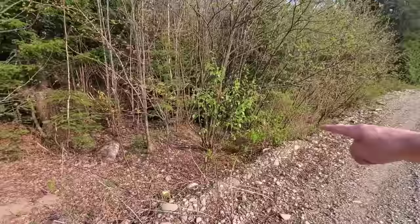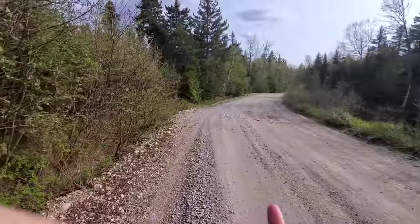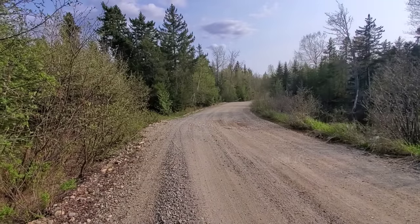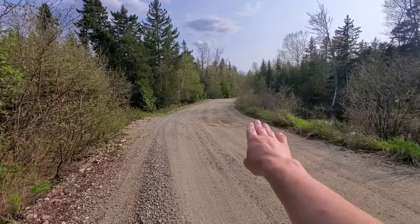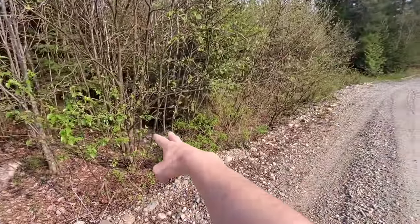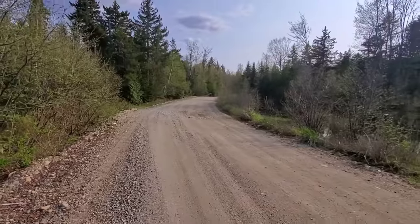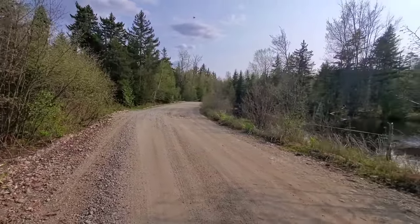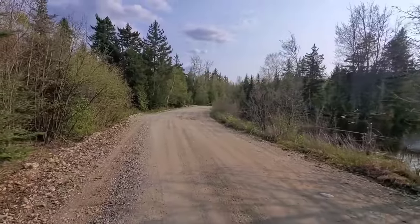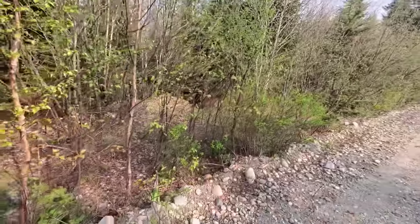Look at this, see all this erosion in here? During a storm, that culvert is too small regardless. The 18-inch one, probably even the bigger one, because what I'm seeing here, a lot of water crosses here. I see erosion all inside here. This whole thing, especially during the spring thaw, goes underwater. Even that 4-foot culvert, if it was fully clear, it's not going to be able to handle that. All through here looks like it goes underwater also.